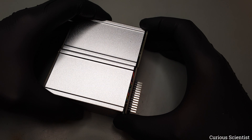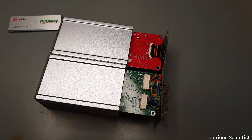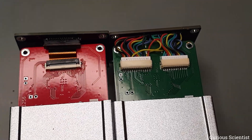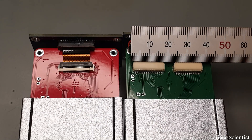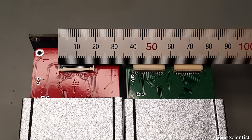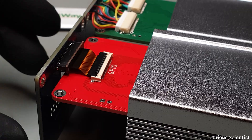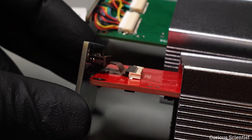Then let's reveal the PCBs. I tried to drag them out simultaneously for a more dramatic effect, but you can see what is happening there. When looking at the FlexPCB it is hard to believe that all that massive wiring can be squeezed into such a small and neat area. I really like it. Also, from a closer perspective, the difference is more striking perhaps. The new connector takes up roughly half of the area of the previous connector, but this is relatively expected as the new connector has a 0.5mm pitch instead of the previous 1mm. Then finally from a side view, the FlexPCB based connector slides in very easily and everything fits neatly.